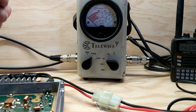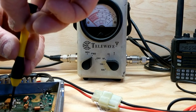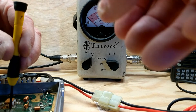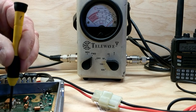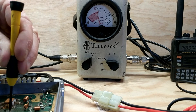I need a little magnifying glass in order to put my screwdriver in VR1, so bear with me a minute. Just a little tiny sucker. So I'm going to put it in transmit and you can see the power go up. Now I've got the radio on the low power setting — if you can see the needle swing down there.